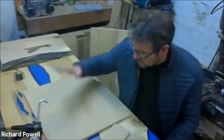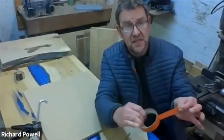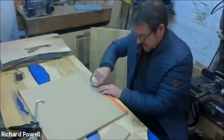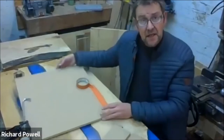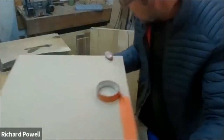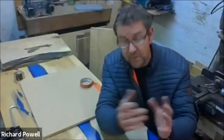The other thing you have to take into account is lining your tray. I use decorator's tape because it's non-sticky. You essentially have to go over your whole tray and line it. When you put your timber onto it and cast your resin, the resin won't stick to the non-adhesive surface. If you don't do this, the resin will stick and you'll have real trouble getting it out of the mold.